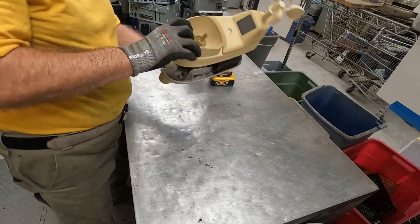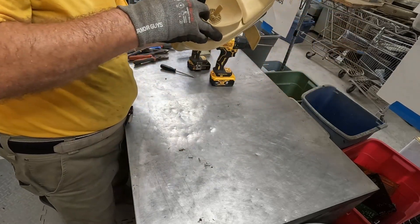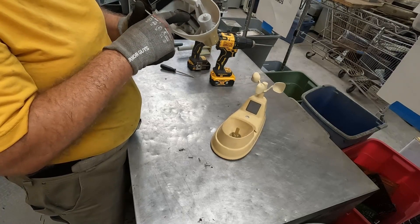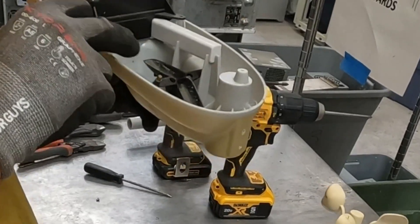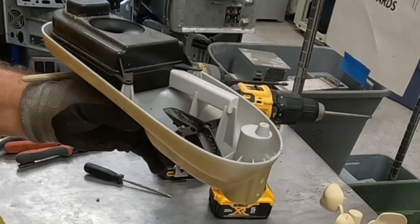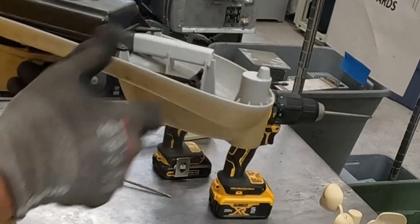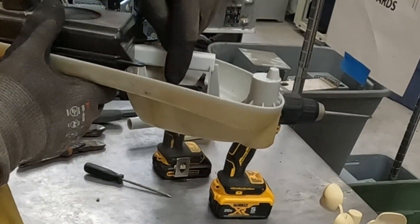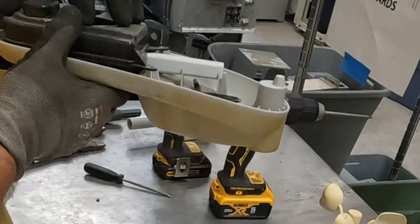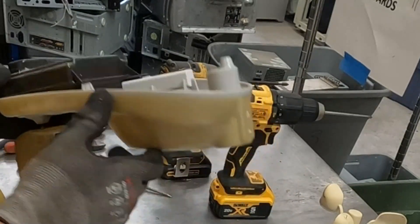Let's look at this rain gauge first — pretty simple system. The water falls down through here, and there's this flapper valve here, so that when the flapper valve would fill to a certain level, it would rotate and dump out the water. That's how it stayed empty, but this way it could tell how much rain was falling. The system would know how much rain would fill up the cup. When the cup was full, it would tip and dump, and that connector there would send a signal to the board, which would calculate how many times this thing was tipping to tell it the rate of rainfall. Very clever device.